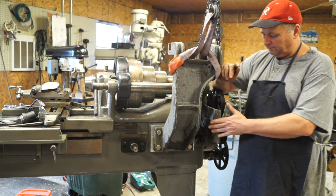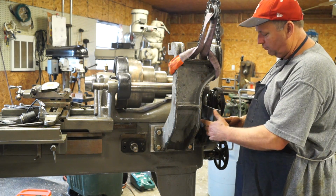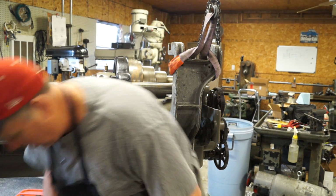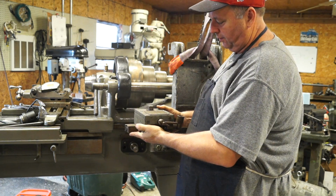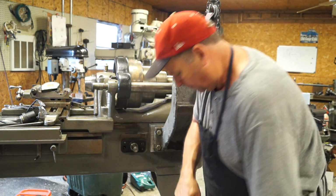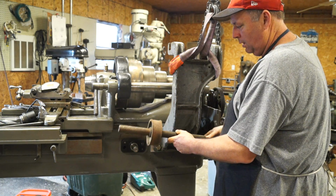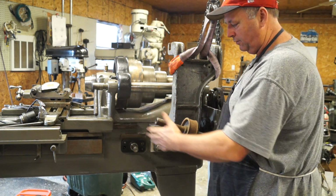Now my relieving attachment, there's actually a gear that goes right here, and I'm not sure where it's sitting right now. But this gear drives a shaft that comes back and drives the relieving attachment. Now, here's the relieving attachment, and it mounts back on the taper, and I'll back the camera up and show you that. But it's got a little drive shaft with universal joints, and then we have a shaft here that actually mounts to this gear that drives it, and there's a shaft that I have to make that slides in and out of this shaft as it's working.